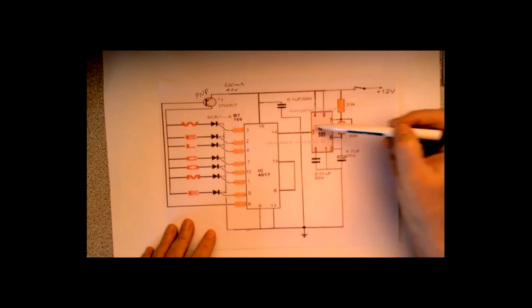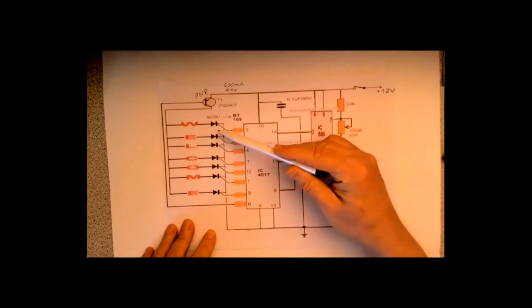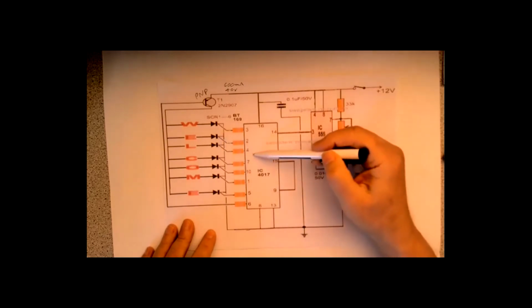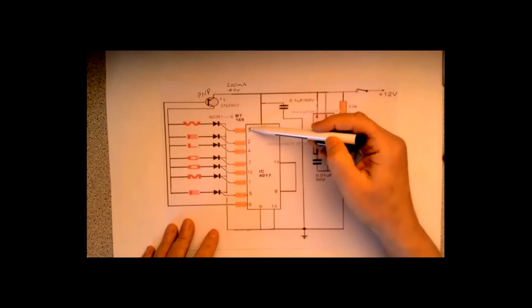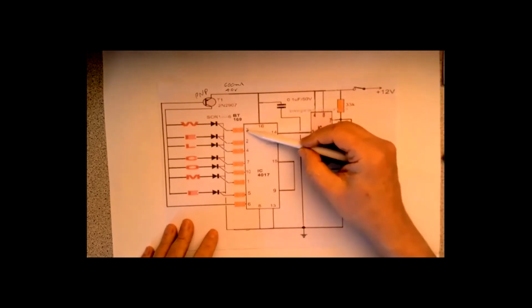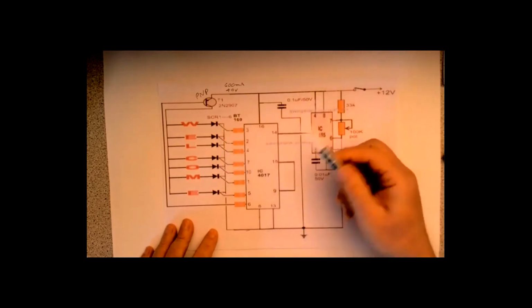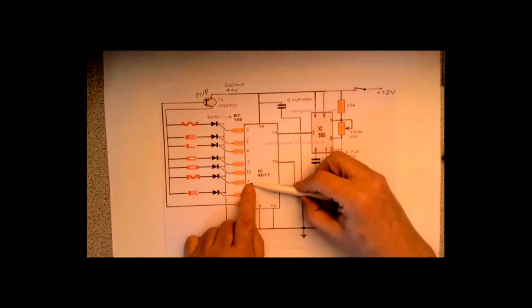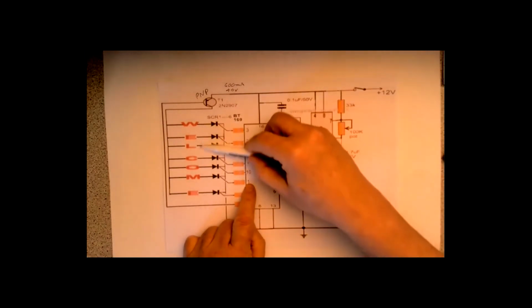And then when you put the next pulse in, it doesn't matter that pin 2 drops to 0 because it's latched. Now if pin 4 goes high, same thing. So it works its way down, and as each of these goes high just for a pulse, they all stay on. So for example, if we got to pin 1 being pulsed, it'll be high, the others will all be low, but they'll all still be switched on.